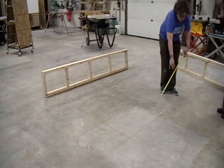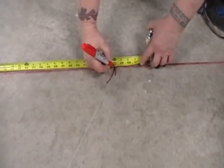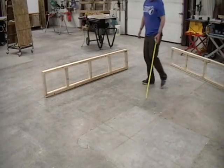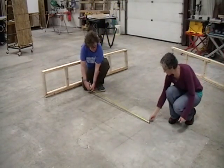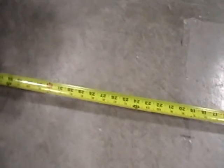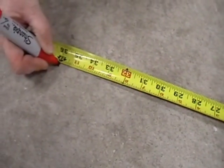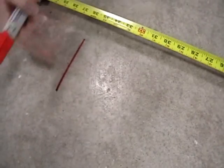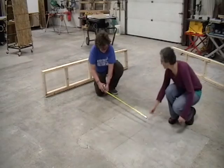Let's have somebody hold the tape measure on our mark. I'm going to place my mark at 4 feet. Next, I'm going to swing over here with the tape measure — I'm still on the same mark — and this time I'm going to mark 3 feet. I'm not sure exactly where it goes, so I'm going to put my marker right on the 3-foot mark of my tape measure and swing an arc, because I'm not sure where along this 3-foot mark that wall will land.